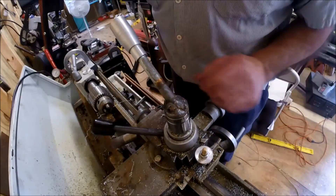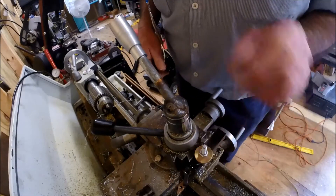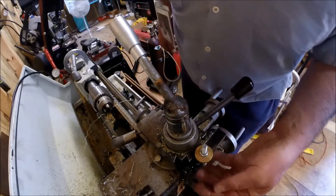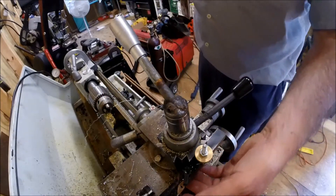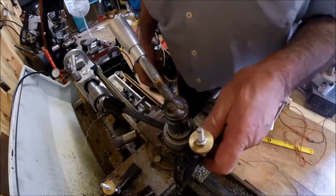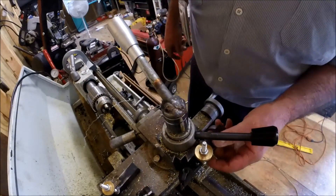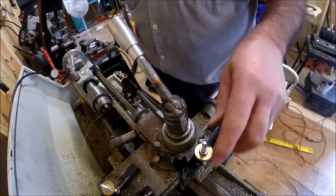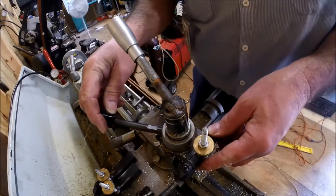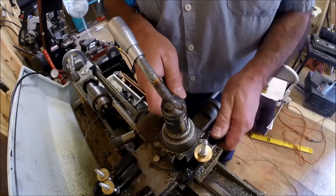You've got a really good view there — that's the CNMG holder. These are the four I've got for this lathe. If there is some rock or a little bit of play, the rock will take it up. The question of rigidity has been asked by several people — you'll see, that's fairly rigid. Sometimes you get a little happy with these. I really learned more on these holders than I did on any of the others.